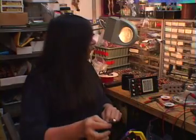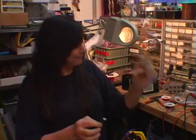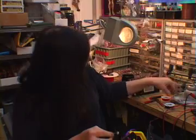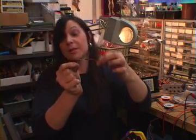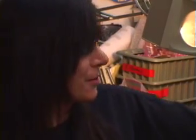They make small ones of these. You can get them at Radio Shack — an assortment of these things, real cheap. You take them and combine them with an LED. There you have a light bulb and a photocell — that's a Vactrol. When you marry the two together, some people take silicon glue and glom them together and make all kinds of things. You can take a bunch of these and put them all around one LED. These are sensitive most to yellow light, so pick a yellow LED if you want the most efficient circuit.